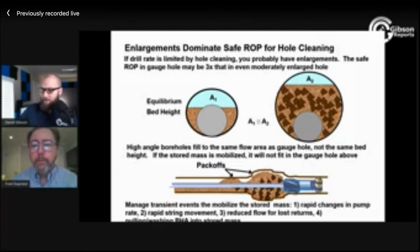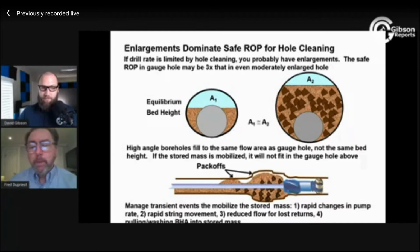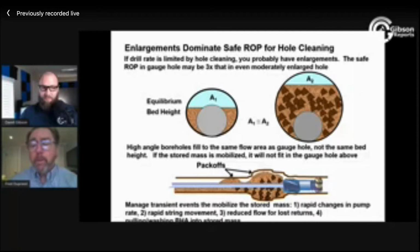The 120, first of all, there's been two decades of research on pipe RPM, probably more than that. There is no rule of thumb that applies broadly. The physics don't support that. So, for example, if I have 5.5 drill pipe in an 8.5 hole, 100 RPM does an awful lot more than 5.5 drill pipe in a 17.5 inch horizontal hole. I mean, just logically, it's disturbing that annulus area a great deal more.